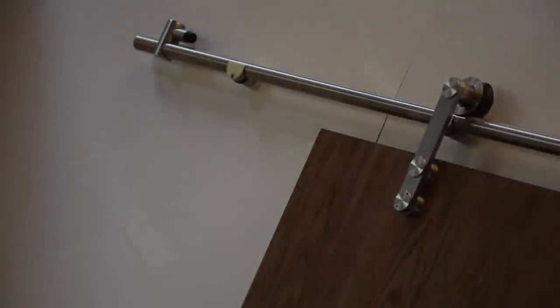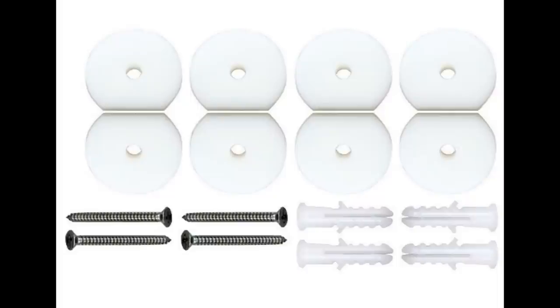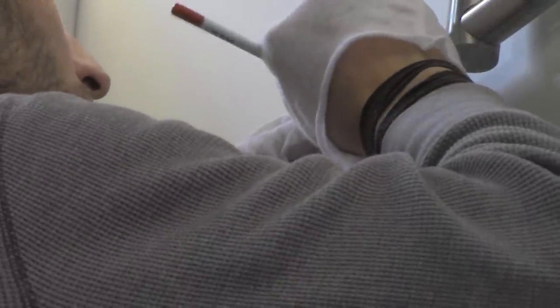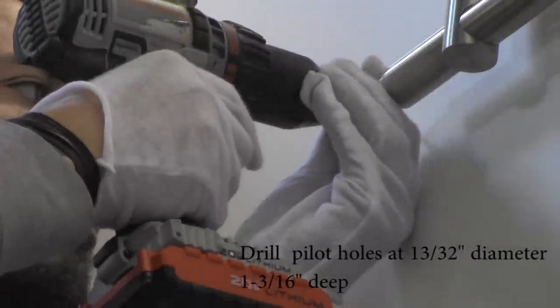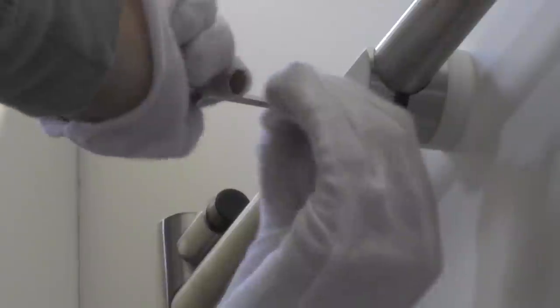Now we will apply the back-to-back mounting hardware on the other side. Insert the door handle over the nuts and use a hex key to tighten the set screws in place on both posts as shown. Now on to the wall hardware. The wall mounted hardware should extend out beyond the door frame in the direction that the door will be opening. There are four brackets included plus nylon washers to serve as spacers, giving the door added depth off the wall. Mark your positions and drill pilot holes for mounting your four brackets. Note you'll want to mount into studs, wood backing, or concrete for a secure hold. Measure and mark each position so that each mounting post is spaced evenly — recommended spacing is no more than three feet apart. Be sure to use a level as a guide to keep the track perfectly aligned. The brackets are comprised of two pieces. Mount the backside of the bracket along with the additional nylon washers as needed depending on your door thickness to project further out from the wall and allow the door to slide freely. With one half of your bracket set in place, fasten the outer portion and repeat these steps for all four brackets to hold the bar securely in place.